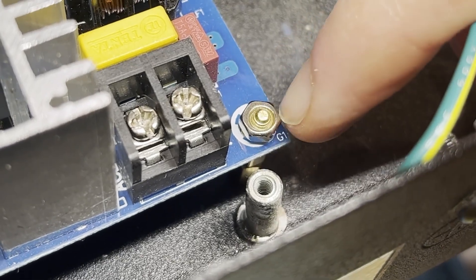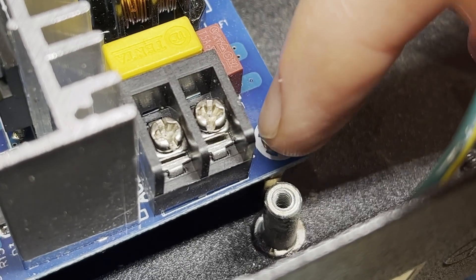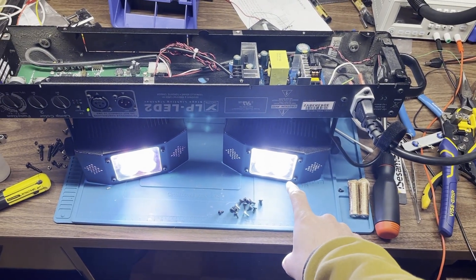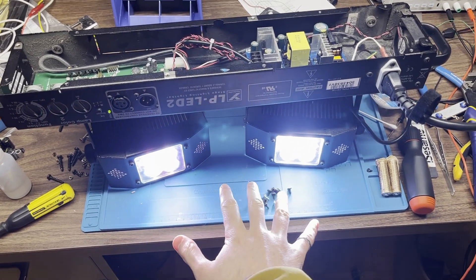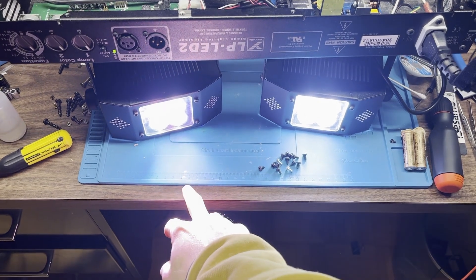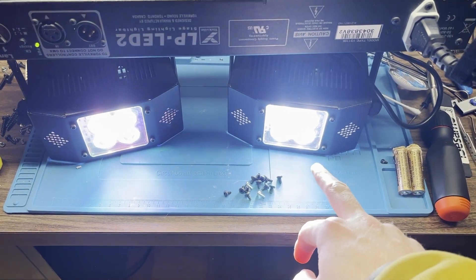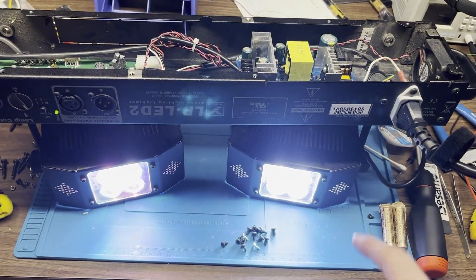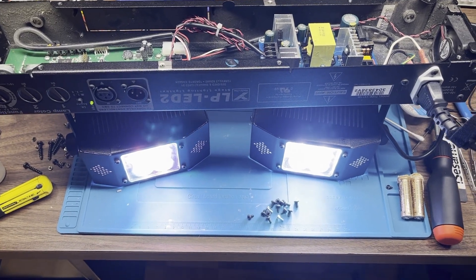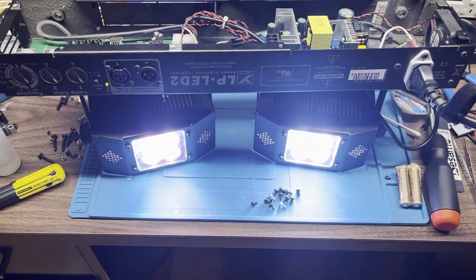Well, I've never seen this before, but this nut — the hole is actually off-center, so as you turn it you're making the whole screw wobble. That's what you get when you buy it from AliExpress. So powered up and running — this is the one that was always good, this is the one that I worked on. You can maybe tell that this one is not quite as white as this one owing to the white LED chip not working, and this one's also a tad less bright. I can see some flicker on video that I'm not seeing in person. I wonder if there is ripple coming from this power supply — it was cheap. But the idea was just to get this back up and running, not necessarily touring grade, so I would consider it a success.